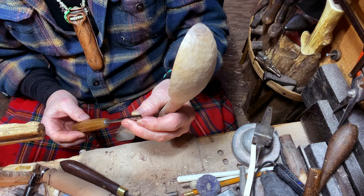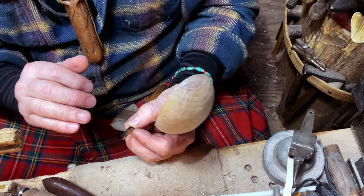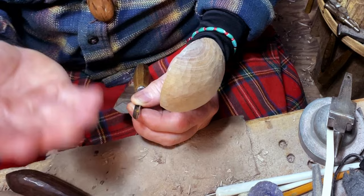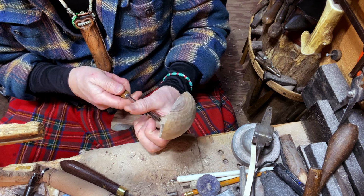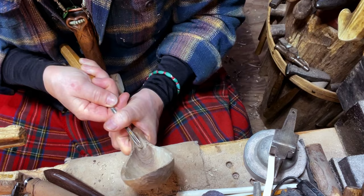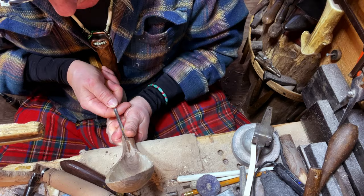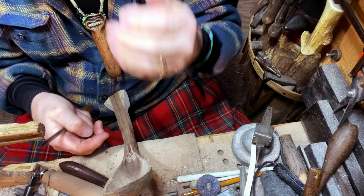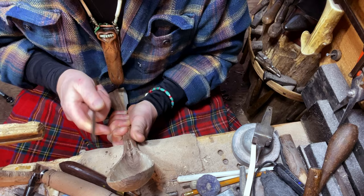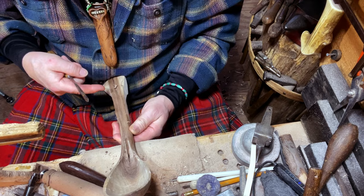A teeny tiny number 11 gouge — a number 11 gouge has such a deep sweep to it and it's very versatile. You don't run the risk of getting your corners caught underneath the grain too badly. You can actually use the sides of these gouges — a shallower sweep would practically be a number three on the side here, so you can use the side or the very belly of it. I'm going to use it for its depth and narrowness, carving out this little channel. I want the bowl of the spoon to actually fold in to the center here, forming the handle. You can see the pith here actually runs just under the surface all the way up, but I'd like to get it out of the bowl.